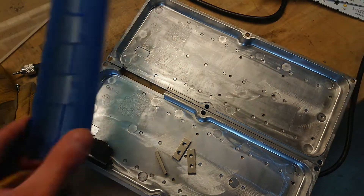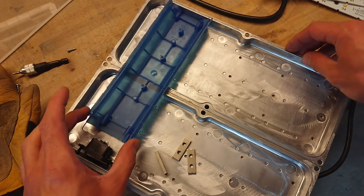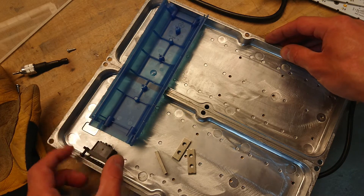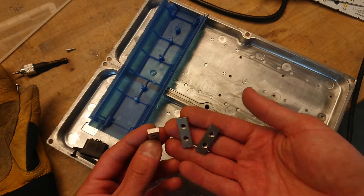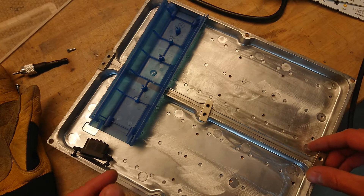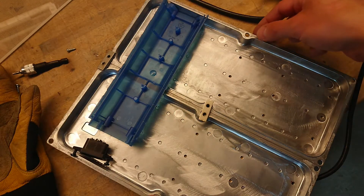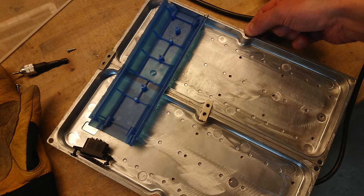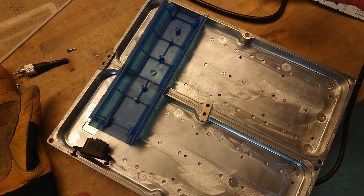With the slots made between the two pieces here, I can put the driver holder inside this piece of plastic — I'll just use this as it's a good way of keeping it isolated from any metal parts. The power input plug will just be this small IEC, which can also just barely sit with its two screws here in the side. I also found some small brackets that I saved from things I took apart, and I will use these at three points to keep the two parts together. A piece of acrylic coming on top will give the whole chassis some more stiffness. I'll probably also make some standoffs on the backside to make some kind of mounting bar on the back so I can put it on a flexible arm or something like that.